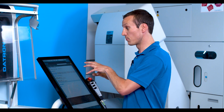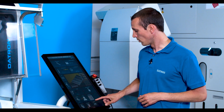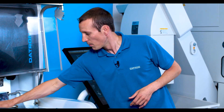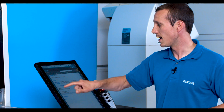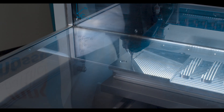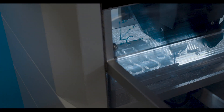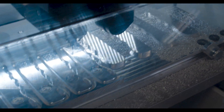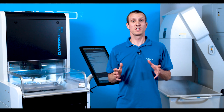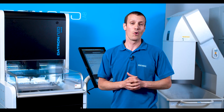So I have two references to different programs that are on the PC or on the network. I'm just loading my origin, quickly turning on the vacuum so my parts are held properly, closing the door, going to the editor and saying execute. Now we've just seen the transition between operation 1 and operation 2, so the machine will now finish the entire part on the right-hand side.